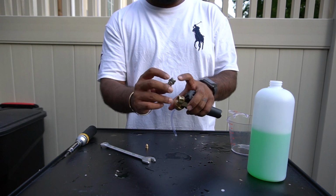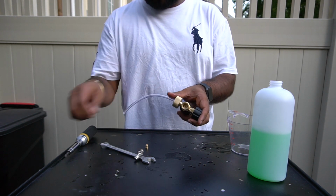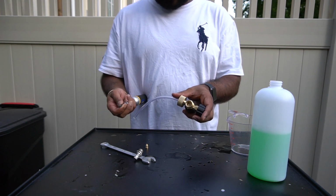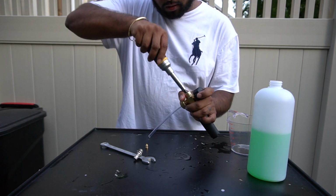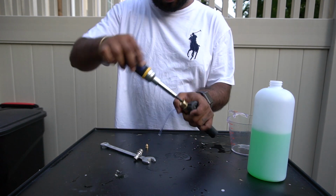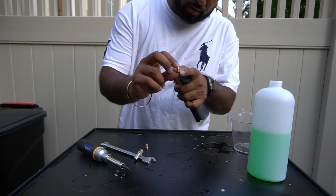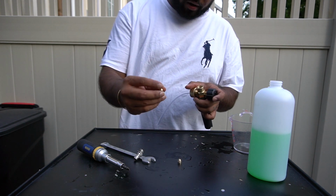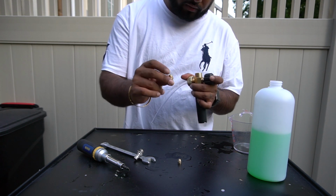Cool, I didn't know this has an O-ring in it as well, so we don't need any Teflon tape. And you can see the orifice that's inside. It is spec'd to a flathead. So let's put this flathead in here and unscrew it. Cool, so this is the stock orifice, and that's nice too. It comes with an O-ring as well. So that's something where this other orifice I got off Amazon, I'll put the part in the description as well, didn't come with one. So let's see if that does make a difference.